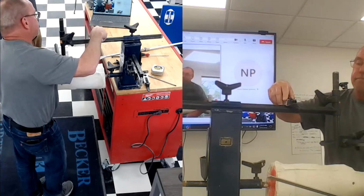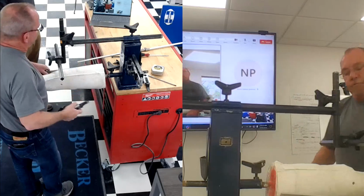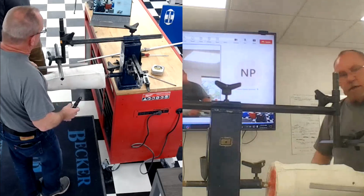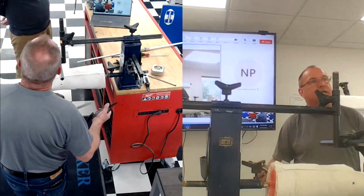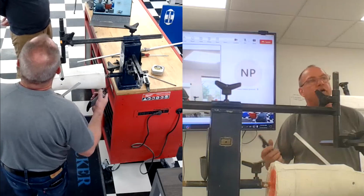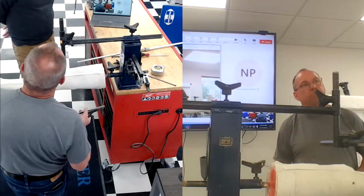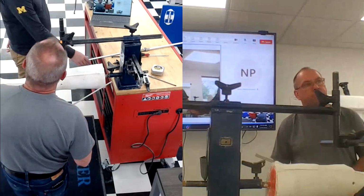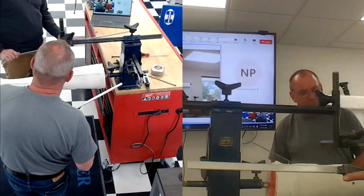So exactly. That's also another reason I think we do that. Yes. If I was doing this and this was plastic, a lot of times if I'm using 3/16 plastic, 1/4 inch plastic, the plastic itself is my identifying marker of my distance from knee center. And your offset of your joint casting. So you're going to try to fit that joint casting as close to the mold as possible for us.